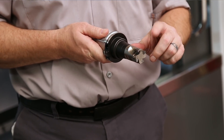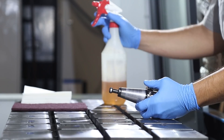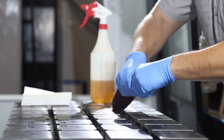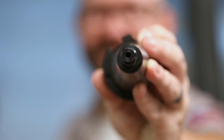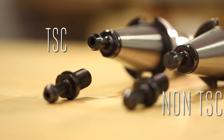I do this routine every time I load any tool: I look at the drill tip or inserts on the indexable end mill and make sure I don't have any chips. Then I take my bare hand and slide across the taper of the tool checking for rust or corrosion. If there's light corrosion, I'll grab some Scotch-Brite with a rust preventative like Castrol Rustilo or WD-40 and scrub it off. If I still feel pitting, it's time to get rid of that tool — you don't want to mar up your spindle. I also give my pull stud a quick tug to make sure it's not falling off, check it for dents, and on tools running through-spindle coolant, I look down the end to make sure there's a hole down the middle of the pull stud.